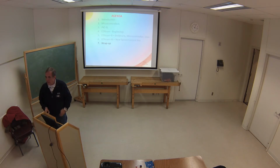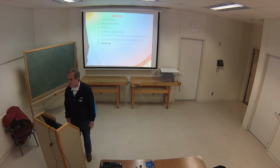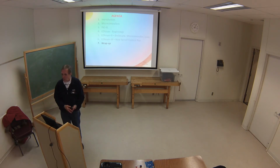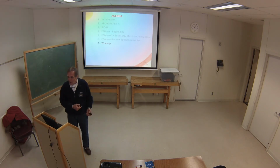Any feel for what percentage of accuracy? They don't even need to do it at full speed. You can key in a W by going dit, da, da. Just because of the way I implement it, a lot of them don't do that. That makes it really simple if you want to put something in at fast speed. Getting dit, da, da at 55 is tough enough with my simple little paddles because they're so short. I'm going dit all the time, and every time you go dit, it would change the iambic mode.